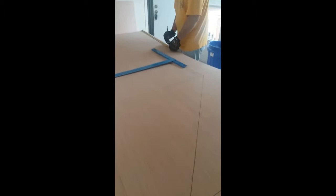Once we get all the linoleum down I'll come back and show you how it looks. Steve has to cut some odd ends for this kitchen — what he's working on right now is the section over there in front of the sink. I'm going to put it in here with four by eight sheets. They're about fifteen bucks each, there are two separate sides, and the smooth side is what you want up because it's really good for the glue to stick very well. And it's super thin.